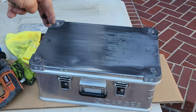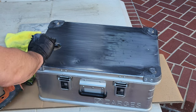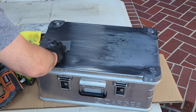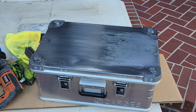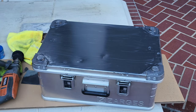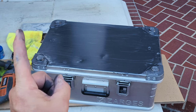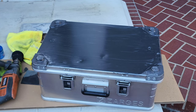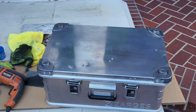I went in a direction — because that's kind of like the natural grain of this aluminum — so just nice and light, kept it in that direction. Then I'll wipe that off, put another coat of polish, and move to a 1000 grit, then a 1500 with three different polishes mixed together. The pad got so wet I squeezed it out — it was kind of nice, wet sanding in one direction. I think that'll help get rid of those uglier swirls. Let's wipe this off and see what it looks like.